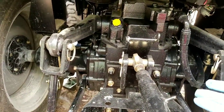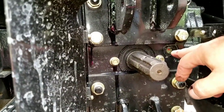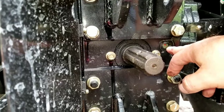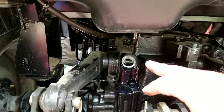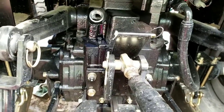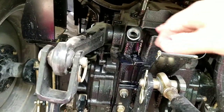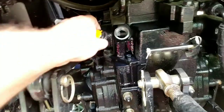I'm done — I was right, it took a little over a gallon. I'm on the upper part of that red dot, which is where you want to be. Another quick tip if you have the 394T: make sure you have a long-neck funnel. The one I used was not long enough. You can use a standard funnel but you'll need to put a tube on it, because the gas tank is kind of in the way. So you need a long-neck funnel.